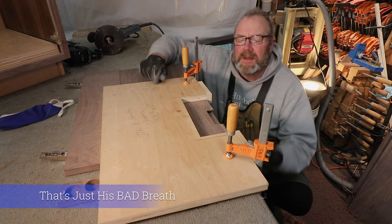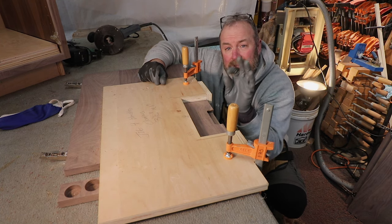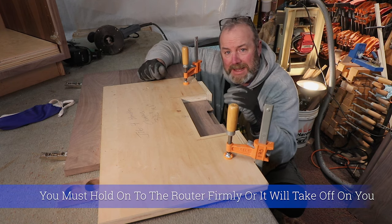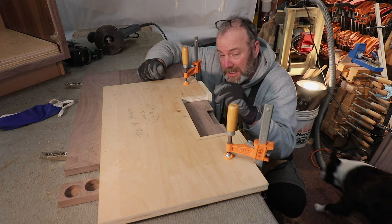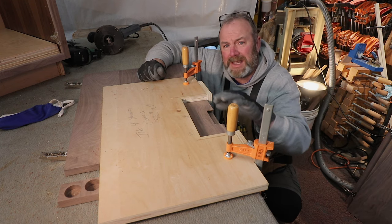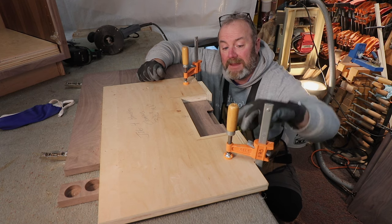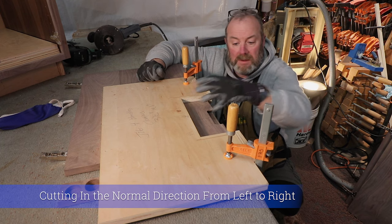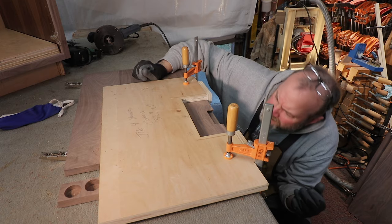So you see how that went — I made several cuts going back this way, going in a little bit at a time. It's like a feel — you feel it going in, and when it starts making a chattering noise you just back off. You want to lightly cut it, put a little pressure but not too much. It cuts maybe a sixteenth to an eighth every time, and you just keep going back and back. Then the last cut, I make sure it's up against the fence and I go slowly forward all the way across and then back out. That last pass cleans up any burn.